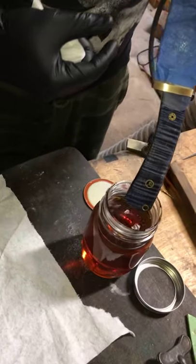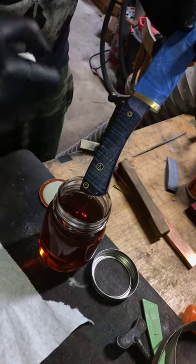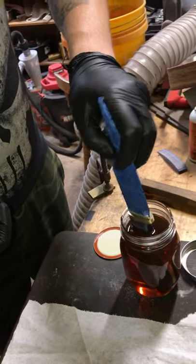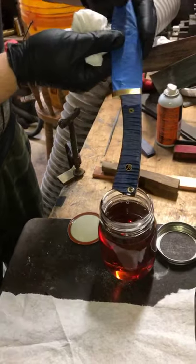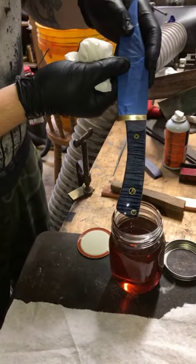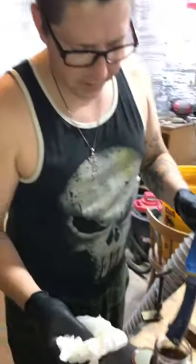See what I'm talking about - just gorgeous depth in that wood. Isn't that beautiful? There's a little bit of character down in the front - see how that wood has some really crazy depth to it? It's like glass. This is hand sanded to a thousand grit and then polished on my jeans a little bit. It's like glass, it's crazy. I'm pretty sure this is stabilized too. Maple is hard as it gets - of course there's harder wood, but it's that sweet spot of being a hardwood without being brittle.